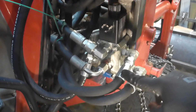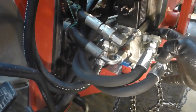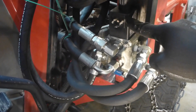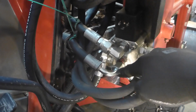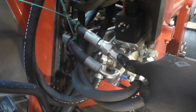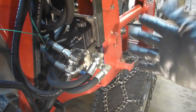The two hoses going to the curl cylinder are going to the side of the valve. When not energized, the solenoid valve will flow these two hoses through to the existing curl cylinder. When this valve is energized, it's the two other hoses at the back that will activate the plow inclination.